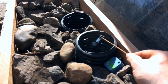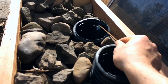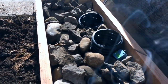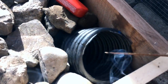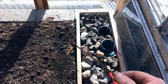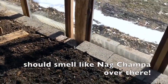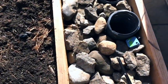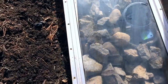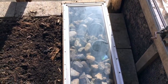Both tubes on the south side are actively drawing air from this little solar rock garden. Not super aggressively, and it goes away if you move the incense up high, but with the glass lid on I know this hot, dry micro-climate space is drawing air through. This last third tube still needs a fan — I don't see it drawing actively. I have a temperature probe in here and I'll monitor over the next few days what temperatures this reaches. The glass on top is meant to keep solar gain focused in there and charge that space.